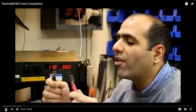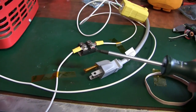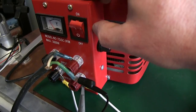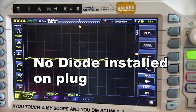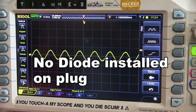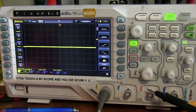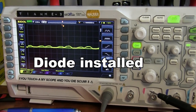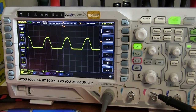You can see it still sparks. Let's try it out. After a while it starts to grow on you — it gets a little bit therapeutic. There are side effects, like your eyebrows might grow together. Now we're just going to increase the chooch factor. See a nice AC waveform coming up — hit the trigger, and that's about good right there. I got a reasonable facsimile of the universal motor wire wound resistor — not quite, but good for proving the point. Across the load we are now seeing DC pulses, so we're only getting half the voltage to the motor.